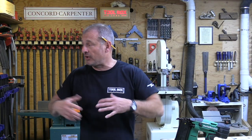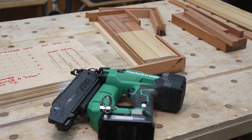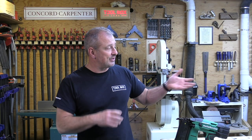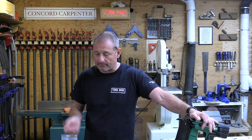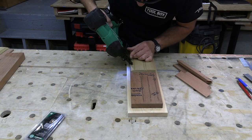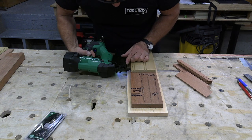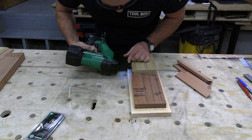For power and performance, we successfully installed brads in multiple types of wood — oak, mahogany, pine, plywood, small parts — with ease. We tested toenailing, tongue and groove, and smaller trim parts in both bump and contact modes. It's accurate, brad placement was right where needed, and it's powerful enough to toenail into all materials tested.